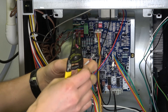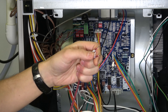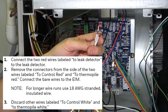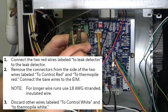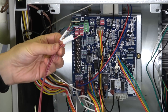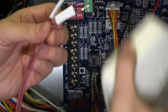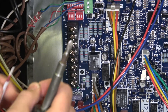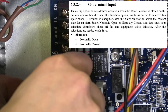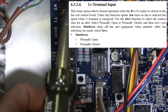This is a little different application than what the manual says. If you're reading the manual, there's a section titled 'How do I connect to a Honeywell Prestige EIM module' — this is the same process as that, so that's what we're following. We strip these wires back and wire them up. These are not polarity sensitive either because it's just a dry contact. I'm going to wire them to red and G.